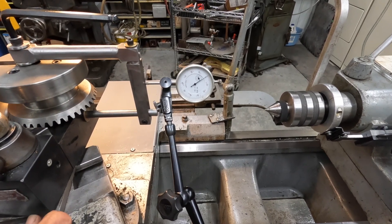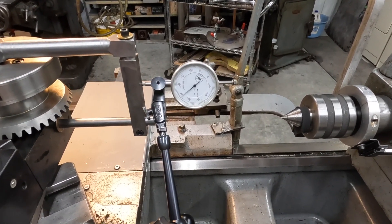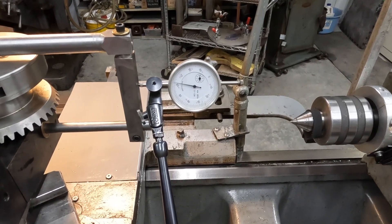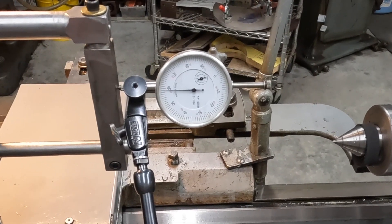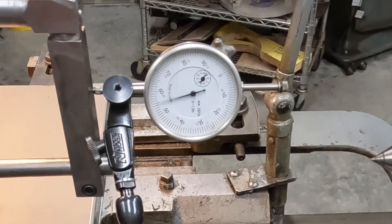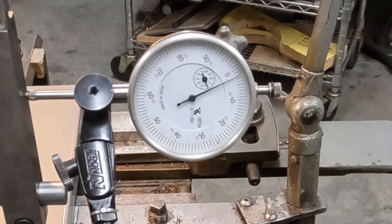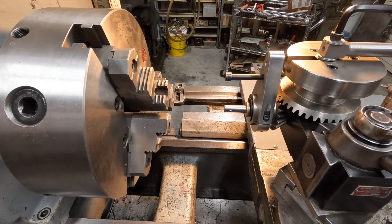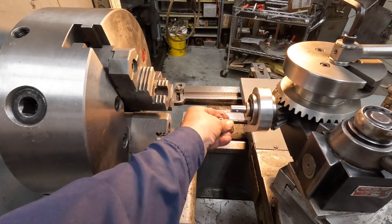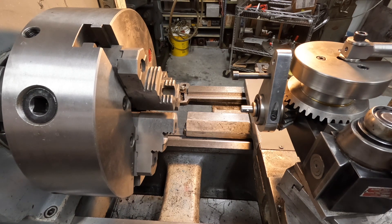One more time just to confirm — seven increments again, 755. That's about as close as you'd want, about five thousandths off. This is adjustable. We want this travel all the way out to the back — that's the back — so that should lock our position in for that.